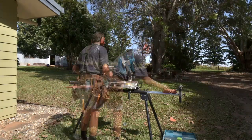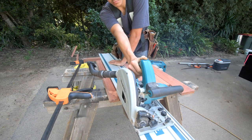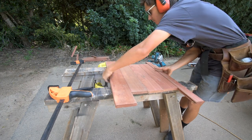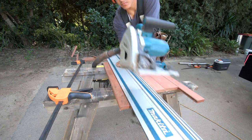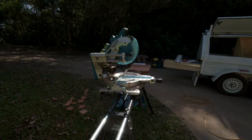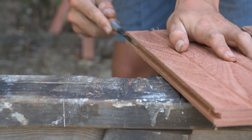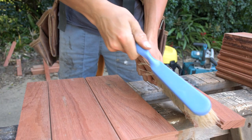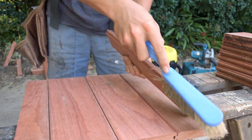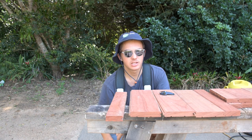Got my cut list for all the drawer sizes and I'm just going to cut them right now. I'm just going to go through with my 6mm chisel and clear out all the grooves and any debris left on the tongue of the board, just so it all can pull in nice and tight and look beautiful.